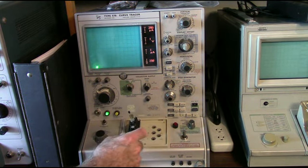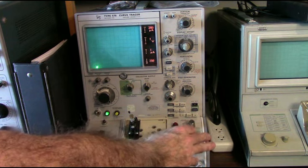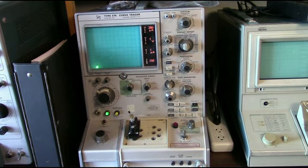On the right side, it's got a similar connection. You can connect the device here. And the nice thing about it is you can do an A-B comparison, and you can match transistors. If you get a device that has matched transistors, or sometimes they'll have a dual transistor that has the same transistor in one package, and I have one piece of equipment I'm working on now that has 6 leads. It's got 2 transistors on the same die, and they do that for stability and matching. But you can actually do that on a curve tracer. You can match two devices.